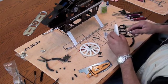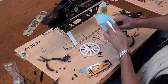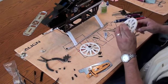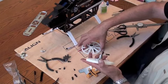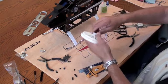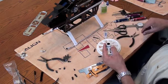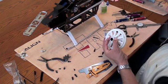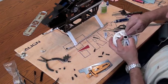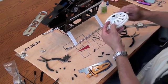Pull back, just check. That's fine. Alright, there's Loctite on those, on this main gear. Again, reinsert this sleeve here. And if you can, put the bolt in now so you're not having to deal with it inside of the frame or when it's on the frame. Again, bigger hand people, makes it easier on you.